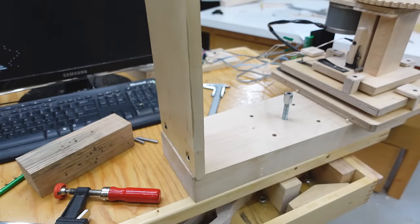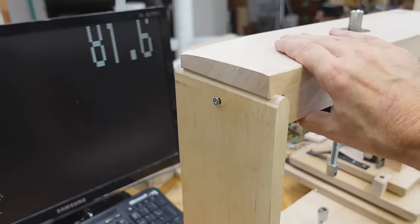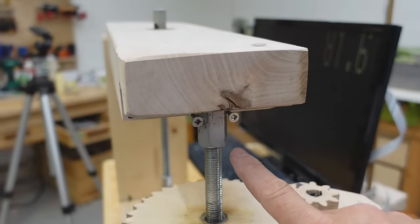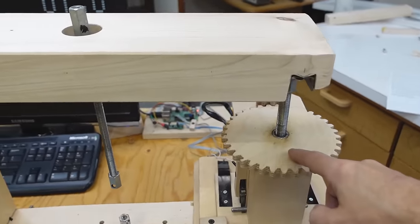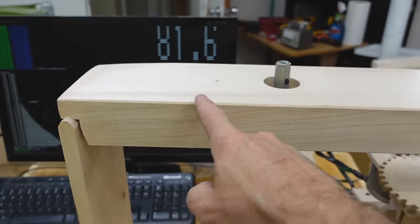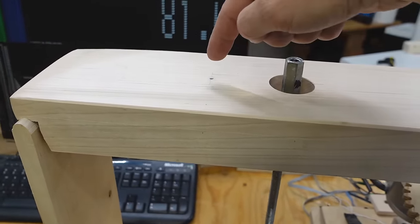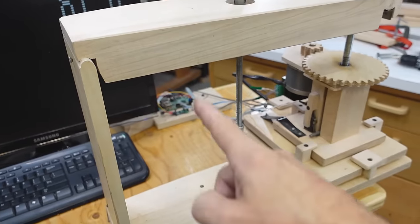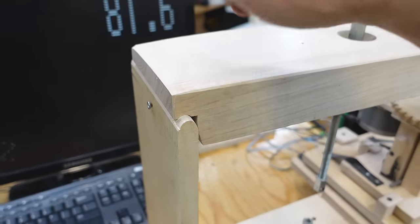So that can pivot on here a little bit now without the ability to jump out of the slot. I added another screw on here that keeps this beam from flying off if the tension is released too fast, and a few more screws to hold this U-channel in place and to make sure my jack is always pushing at the center of this beam. This jack I think I've taken it up to about 350 kilograms, which means with this beam doubling the force I could potentially pull 700 kilograms. But if I move the screw to the one-third point, that means I'd be tripling the force, which means I could be pulling a ton right here. But the question is: could this cause the wood to split? Maybe I should put some reinforcing screws in there — but would those screws be strong enough? Let's do an experiment to find out.